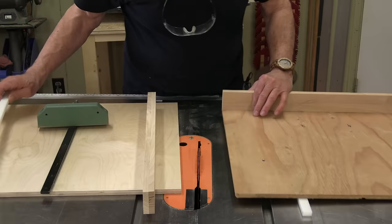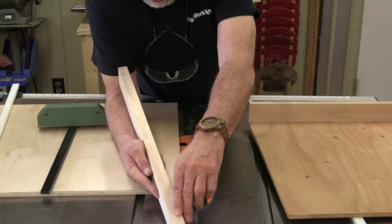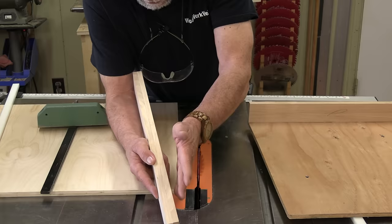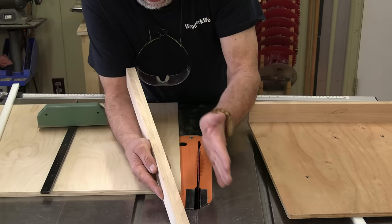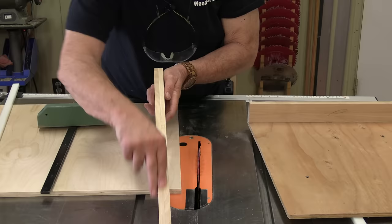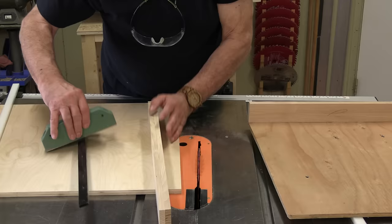The back of the prototype sled is just a single piece of about half-inch wood. For this new one, I've laminated a couple of pieces of beech — it was straight and flat when I laminated it, and I've now run it through the jointer so it's absolutely perfect and flat. The reason we use laminated wood is that it will stay flat and straight its entire life; it won't bend or warp. I've never had laminated wood do that.